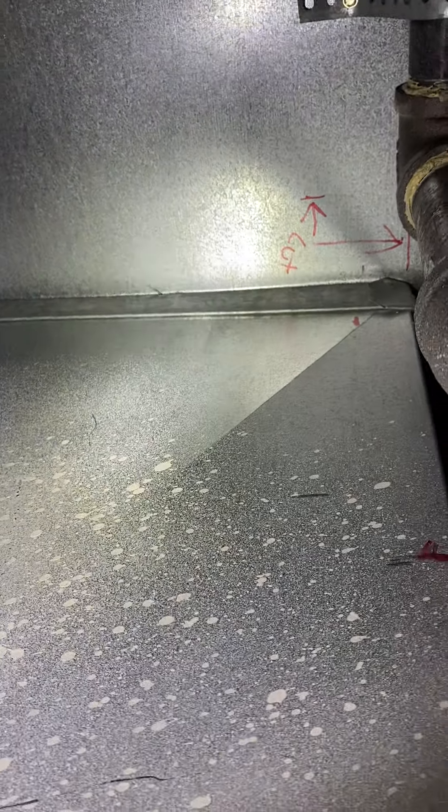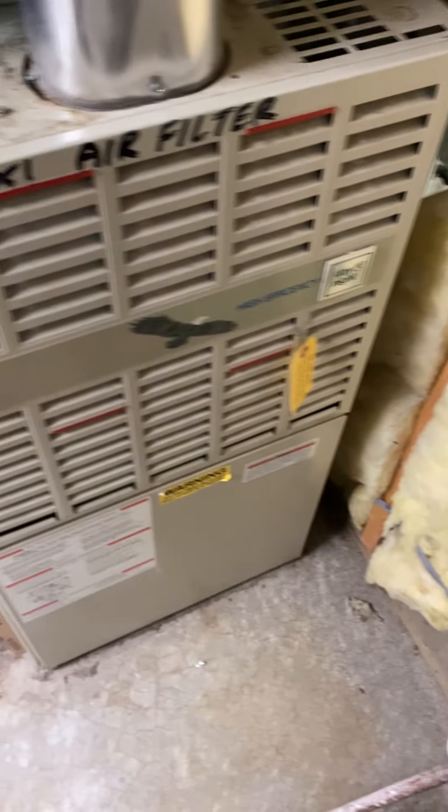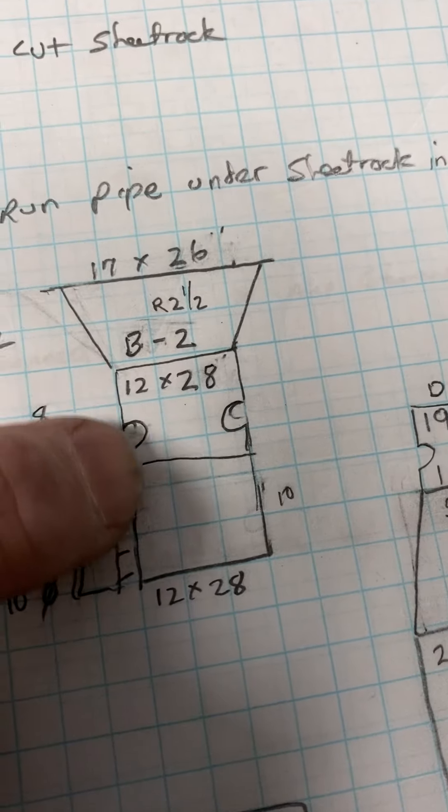There's a cut line right here in the supply and cut lines up there on the return. On the duct, as it shows on the back, there's also a cut line. We'll be one inch in with our starting collar, then it offsets two inches over. The furnace will sit one inch off the back wall and the same distance off the right wall.